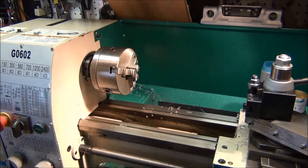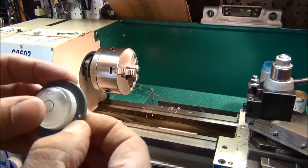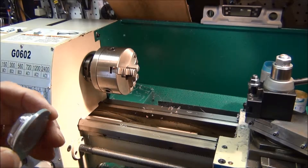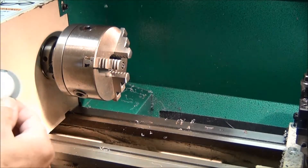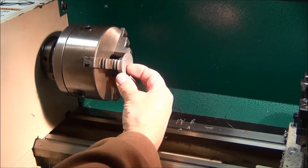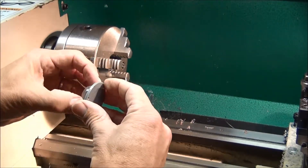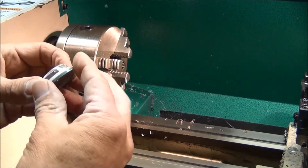I do need to modify this first. It's just this gray ring around the outside where you can screw it onto a surface. I'm going to take most of that off in my lathe. I'm going to mount this in the lathe, but I'm going to have to space it out because I'm going to have to trim that edge down slowly. When I put this clear piece in the chuck I don't want to ruin it.